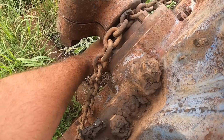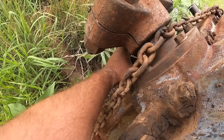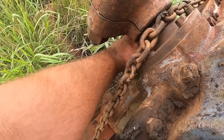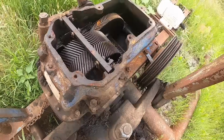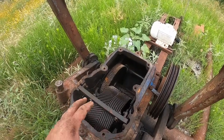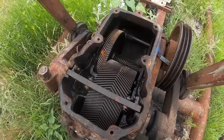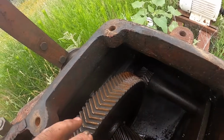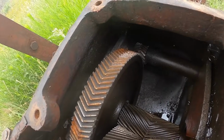And I think probably that this is not the right oil level, and this had the oil level critically low. And what little bit extra leaked out, a couple of quarts, it actually ran out. And that's what has happened here, is this thing has run out of oil and thrashed this gear and this gear and probably the bearings and who knows what the heck else. We're going to scatter this thing and fix it.